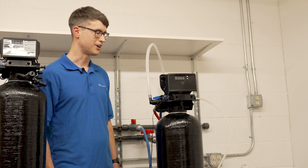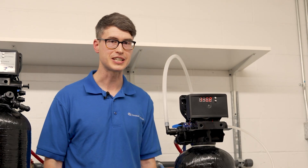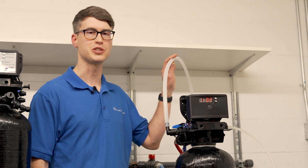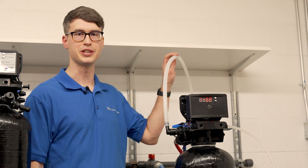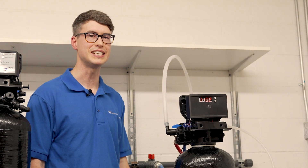You can also look inside the valve body and make sure there's no blockage in there either. If this is a new installation, make sure that your drain line is no longer than 20 feet in length. If it is longer than 20 feet it should be three-quarter inch; half-inch lines should be no longer than 20 feet. Also make sure it's not teed into any other lines.